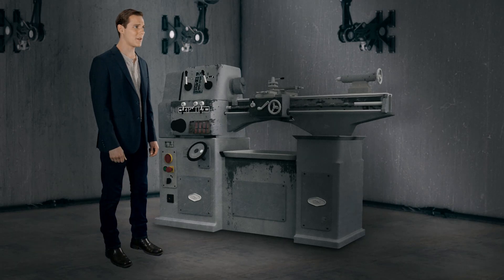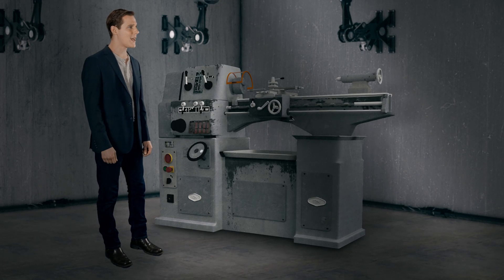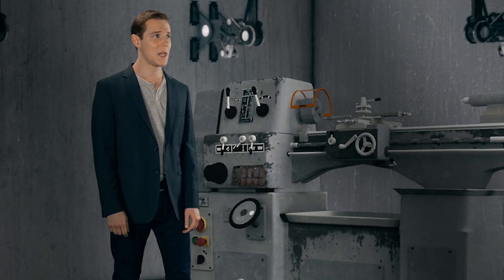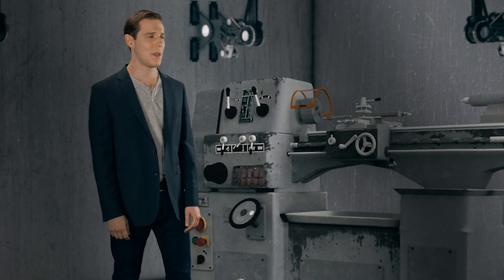There are several controls that could be put in place to reduce this risk. You could require workers using a lathe to wear approved clothing that isn't loose. You could also place a guard over the chuck and require workers to use it while the machine is running. Though this is a better method than the clothing requirement, both should be implemented. However, there's a major weakness: human error. In order for these controls to be effective, the workers need to remember to use them.